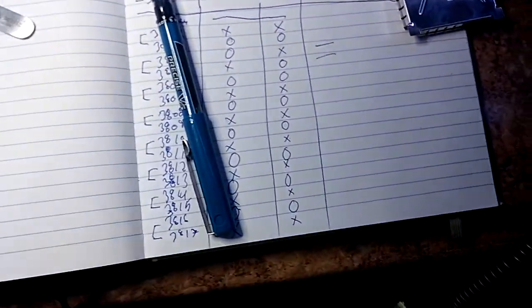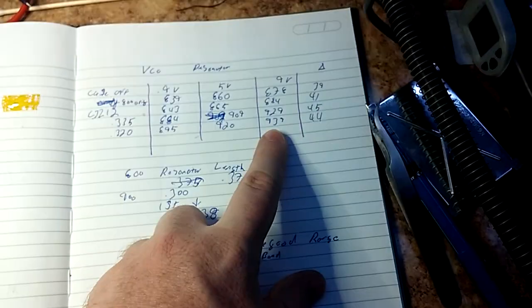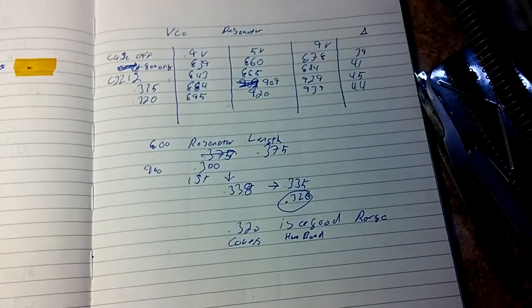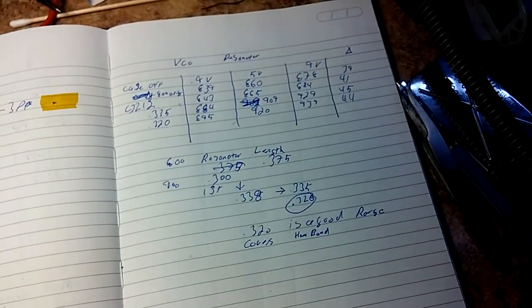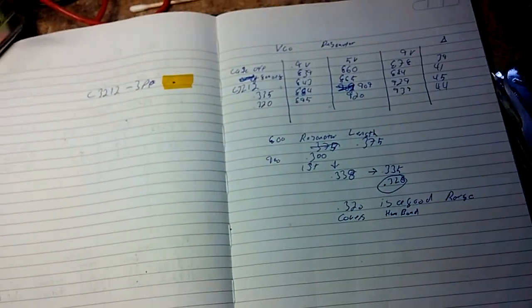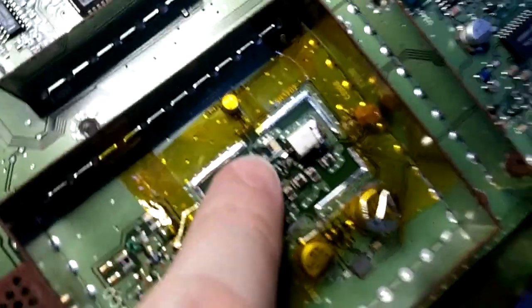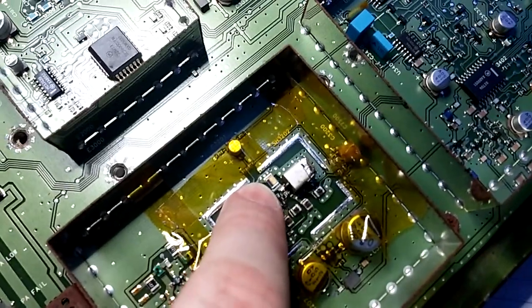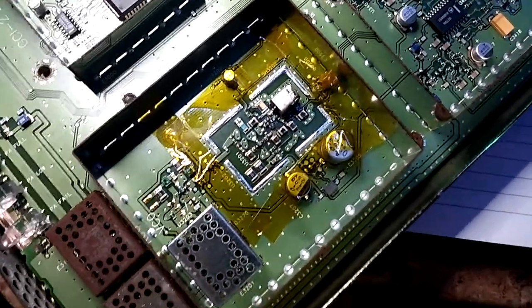The interesting thing is it's a wideband receiver. Here's some of the ID stuff you get to change. It'll actually lock from 895 all the way up to 939 MHz — that's a pretty nice 44 megahertz split at 9 volts. When you put that shield on there, it's going to raise the frequency some too. You can raise the frequency by trimming that capacitor — it's a laser etched one, but a Dremel works just fine. It raises the frequency up a little bit because you probably don't need the low end frequency side.